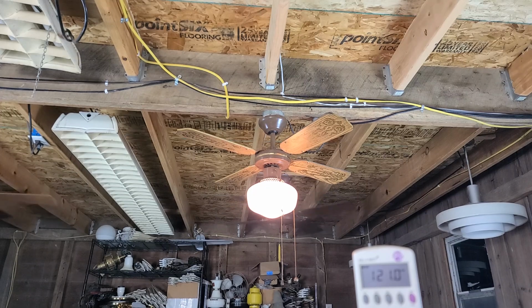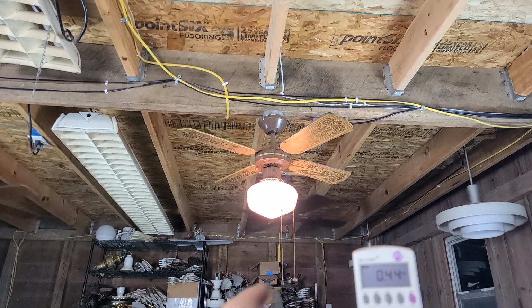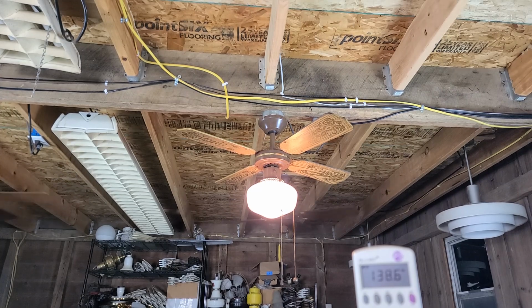So you asked me what kind of bulb is in there. It's drawing 50 watts, so I'm going to guess it's a halogen energy saver 60 watter. Close. 130 volt 60 watter? Yep, that's it. It's a little wonky because, crank it up to 130 and see what it can actually do. Oops, we went up to 135. 138. It looks a little more like a normal 60. I always find that funny.